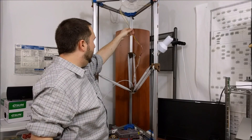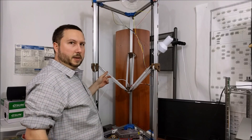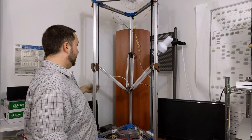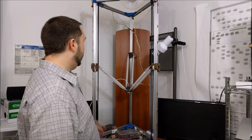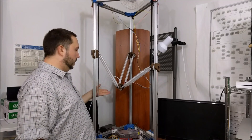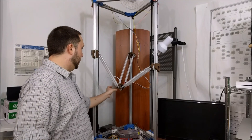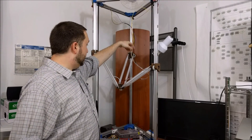The big problem I'm having right now is that these wires are just so heavy, they're knocking the magnets out of their sockets. I'm going to have to come up with some way to hold these wires out of the way, and the same thing with the Bowden tube. But as you can see, when these trucks go up and down it moves the effector side to side, and due to the geometry of it this is extremely stable — it stays perfectly level, so it should give really accurate prints, just as soon as I figure out how to get the wires out of the way.